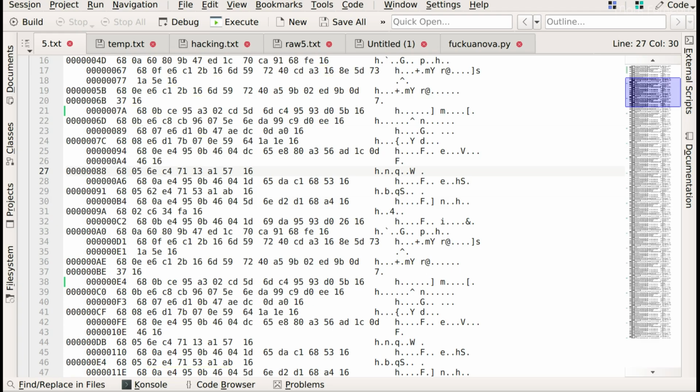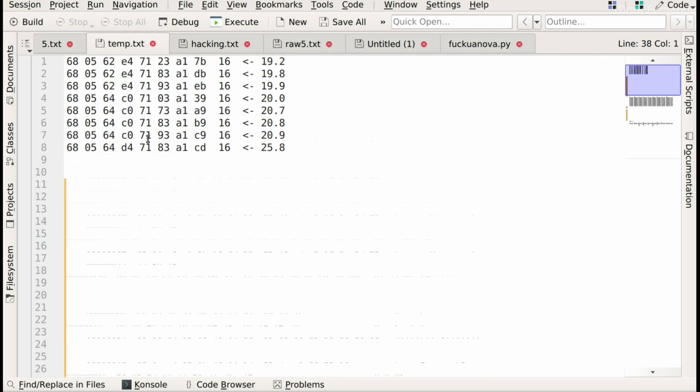So now I turned to trying to figure out how they're encoding the temperature data. And for this, I need known temperatures and packets that definitely contain that temperature. So what I did was I would heat up the sensor on the device, do a packet capture, and then unplug the device when it was at a certain temperature. Then I'd know that the last temperature packet in that capture had to be that temperature. I did this a bunch of times, so I came up with a bunch of different temperatures. I would have liked perfectly sequential temperatures, but I had a bunch of different ones, so it was good enough for me to determine how they were doing the encoding.